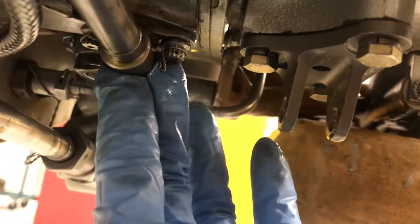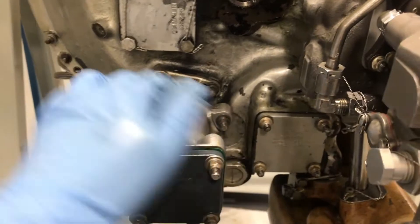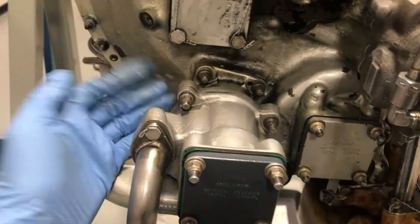For the second stage of the oil returning, which is from here — it comes back to the auxiliary gearbox, driven by the scavenger pump built inside of this case. And then back to the oil tank on this side. That's it for the oil.